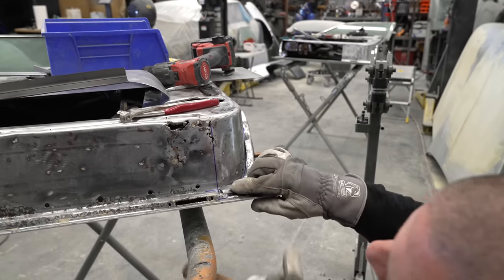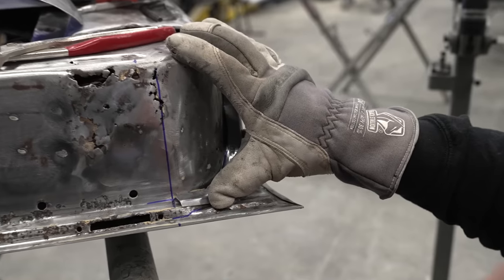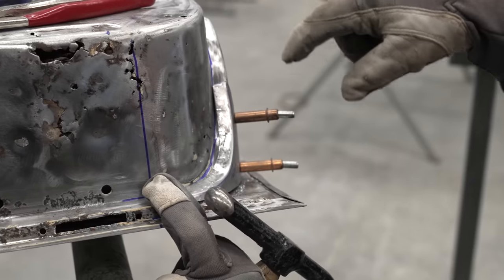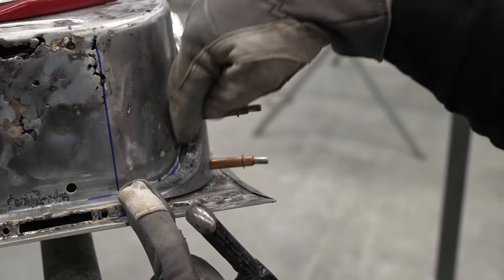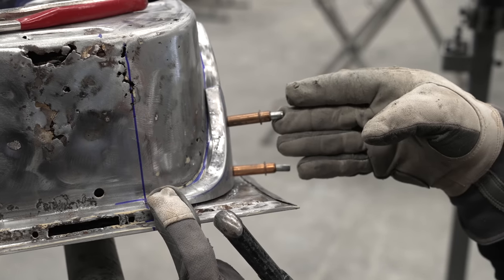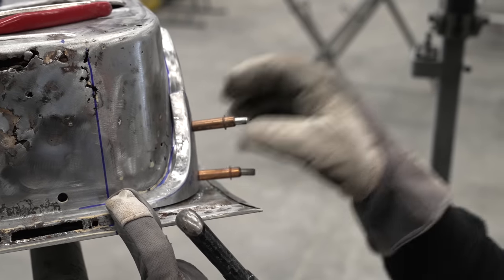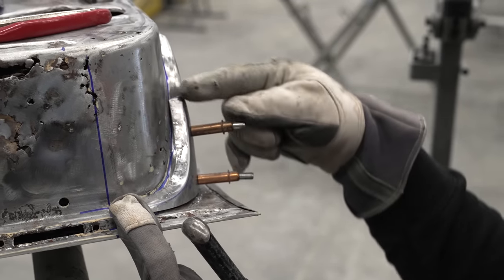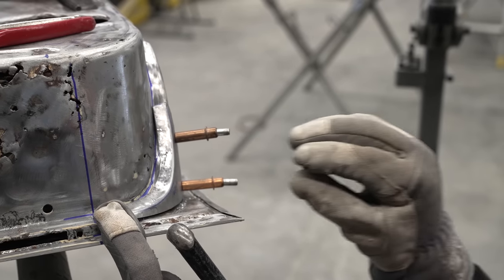And now keep in mind, you can see here at this edge, when we push this in, it's a tiny bit shy of where it needs to be. And this edge is a tiny bit shy. But as long as it's uniform, we'll grind this to where it's the same distance. And when we remove this corner, this will go straight in, and that will take up our gap. So we will dissect this piece by grind, marking around it and removing it until this piece fits in there